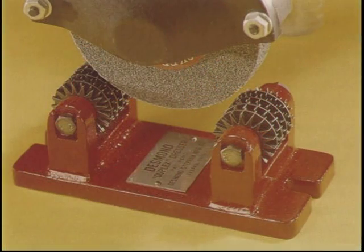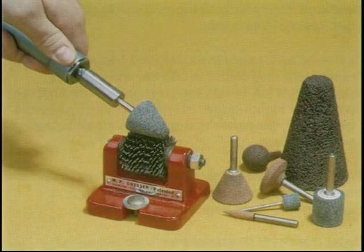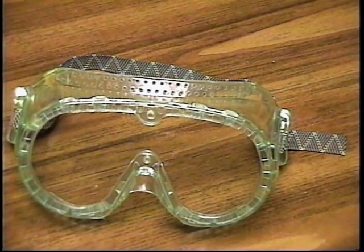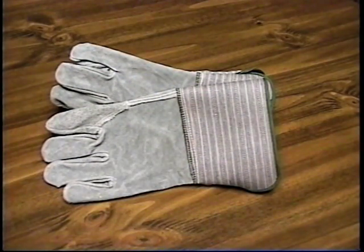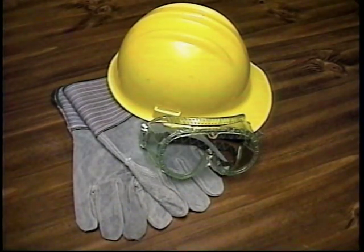Other dressers help keep other grinding wheels sharp. This duplex dresser is for portable grinding wheels 4 inches to 8 inches diameter. A cup wheel dresser restores cup-shaped grinding wheels. Small mounted points and abrasive plugs can be quickly restored and reshaped using a mounted point dresser. Desmond cautions you to always wear safety goggles, a hard hat, and sturdy gloves for dressing or truing foundry grinding wheels. Your shop may require the use of other safety equipment.